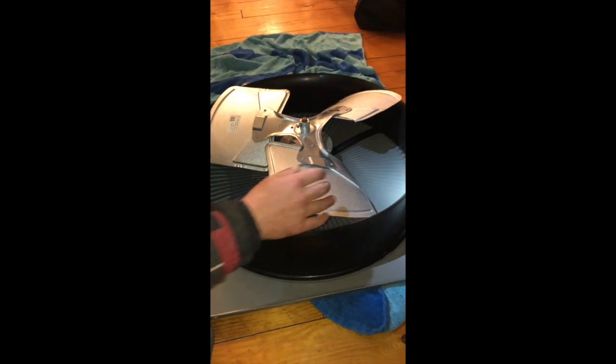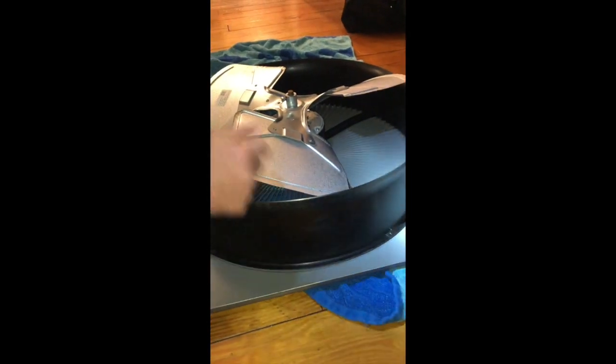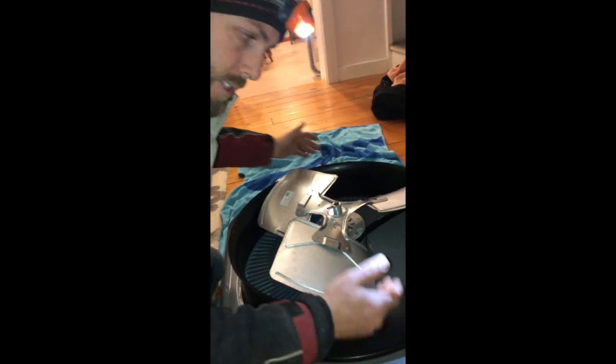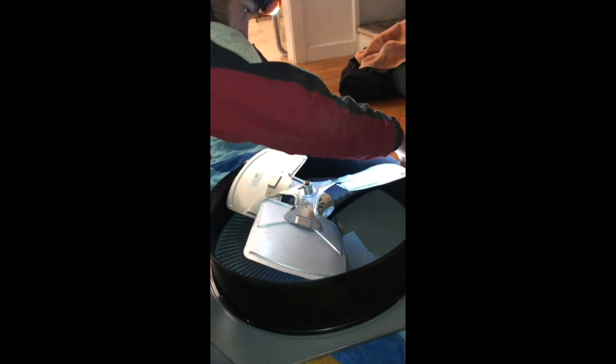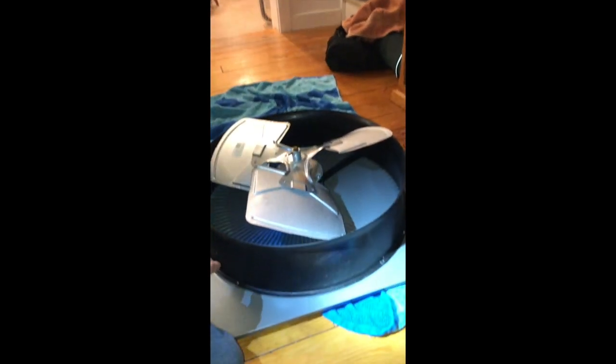And now all I did was I pushed right here because it was rubbing here, and it's now seated here. Now look at my fan blade here. Look at the distances I have. No more rubbing. Okay, so again, if your system sounds like a machine gun when it's running like that, take this thing off and push the other direction on the shroud.